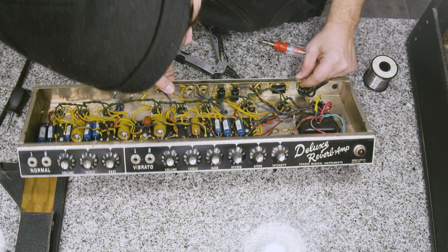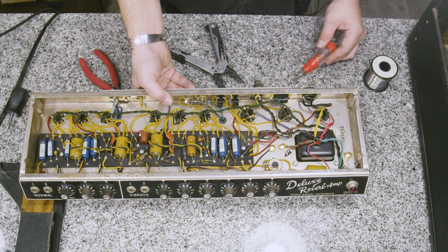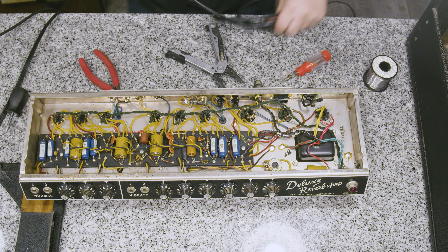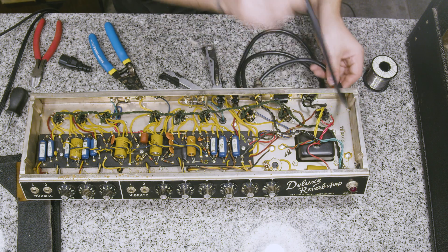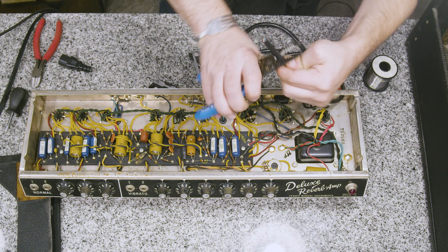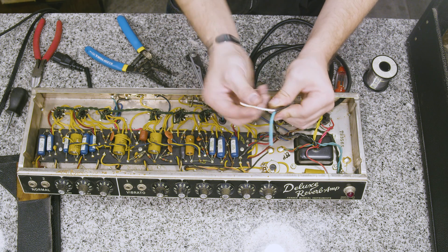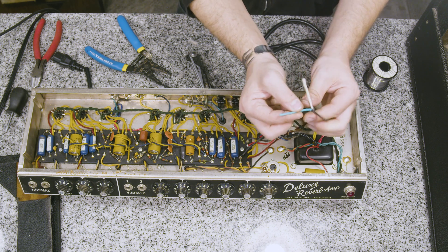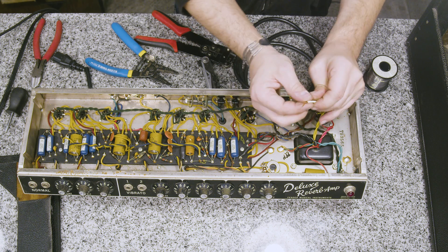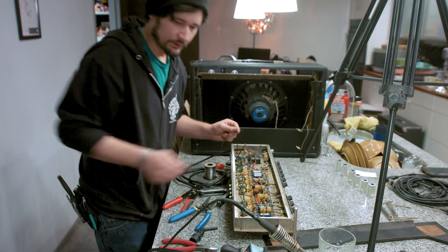Here's where your two new leads are going to connect. Your neutral wire is going to connect to where the white wire — or what was once a white wire — was. Your live will go to the other side. We've got an old IEC cable here — we're just going to lop the end off to provide our three-prong cable. We'll cut back some of the sheathing to reveal our three cables: black is going to be your live wire, white is going to be your neutral wire, and green is going to be ground. Then we're going to tin or pre-solder your neutral and your live wire, which will make soldering them to the switch much easier.